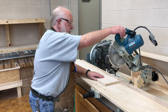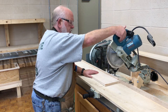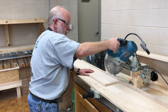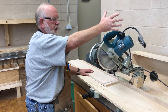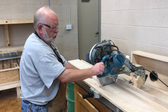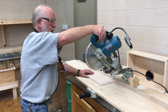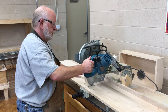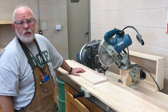I'm going to set it up and put my mark right on the line. I want to make sure the board is pressed in tight against the fence. Keep my hands out of that 6-inch margin. I press the top button and pull it through the cut — see how I let the power button go? Here is the scrap wood; we have a barrel right there for it. I'll do one more demonstration pushing the saw blade through. That's the correct use of the miter saw.